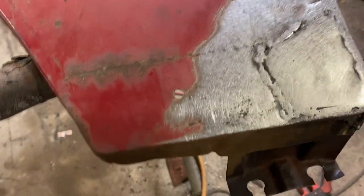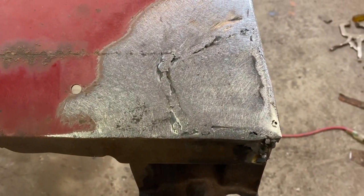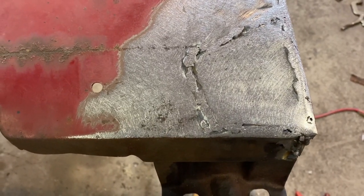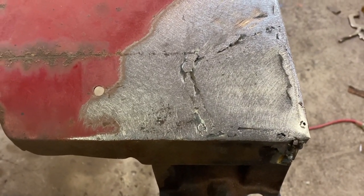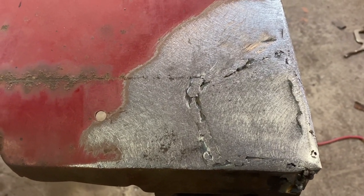Covered with a slight little coat of tiger hair, and good to go. I'm happy with that. With a TIG welder, I could do a much better job of making it flawlessly seamless, but I don't have one. And I'm not going to sit there and grind and weld too much with a MIG, because you start getting thin metal and then the metal will pop.